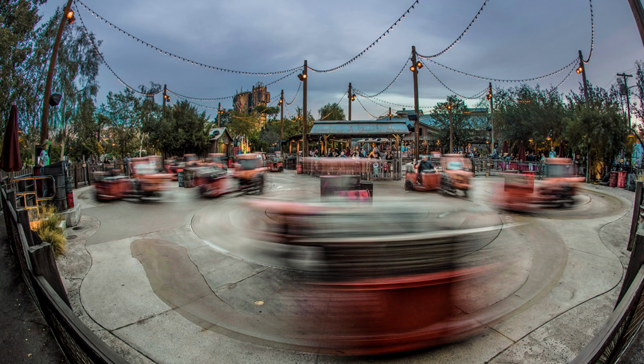To understand the ride system better, we should first start with the vehicle assembly, which consists of two shuttle bars with small wheels on each end. On the bottom of each bar is a flat vertical metal fin that works into the transferring motion of the ride. Each shuttle bar hinges on one end to the central support column, like wings on a bird. This column then rises out from inside the mechanics of the ride to the rider vehicle.